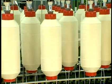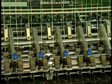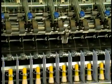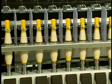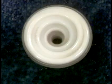Because of the popular preference for ring-spun yarn with its higher strength, more authentic vintage look, and softer hand, many open-end yarn suppliers are producing ring-like yarns, sometimes referred to as rough-spun. These effect yarns are produced by varying the amount of fibers to the rotor spinning box to intentionally make the yarn more uneven. The yarn can also be made hairier and softer by roughing up the yarn surface as it leaves the rotor spinning box. A ceramic navel with grooves causes some of the fibers on the surface of the yarn to pull free as the yarn is pulled across the navel.